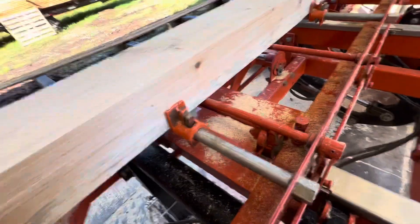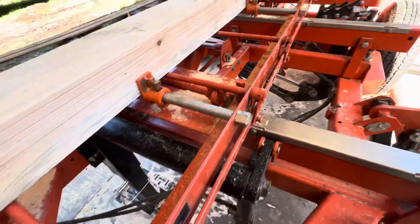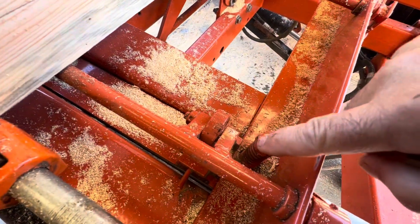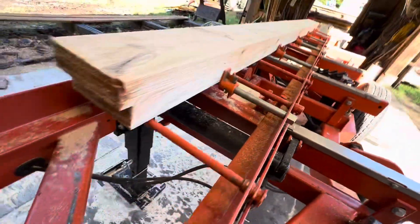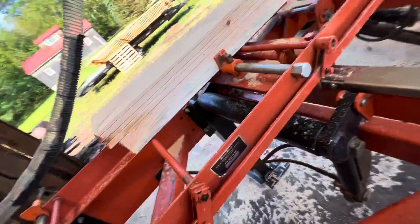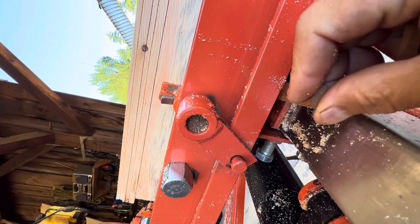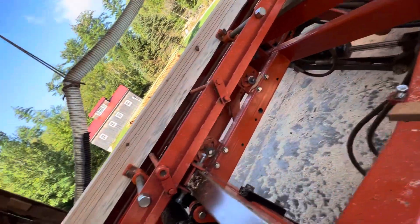Now the next thing I want to talk about are these stops. Mine are painted orange; on some of the new ones they might be aluminum colored. Let's put the lever down in the down position and watch what's going on here. As that goes down, you'll notice this whole assembly is touching off on here. If you jack this down in that position, it's going to lift this side up and reduce the amount of angle you have on your clapboard. If you look under here, you can see this space right here — that's what that screw adjusts when you're in the down position. You could use little shims like this to make sure that this side is at the right height, and then adjust your other side to match.